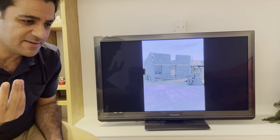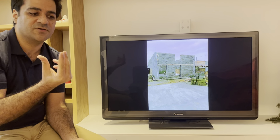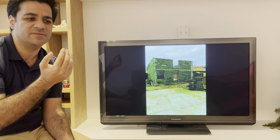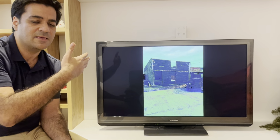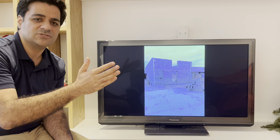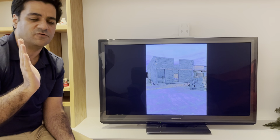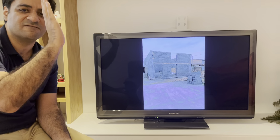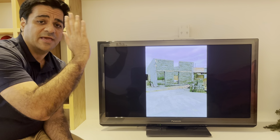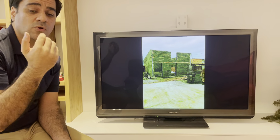When we talk about the building, it is better to start with a rectangular shape. For example, if you want to start with 100 square meters, it is better to have a width of 5 meters and a length of 20 meters. 20 by 5, 100 square meters. For 60 square meters, 5 by 12: 5 wide and 12 long. 5 by 12, 60 square meters.